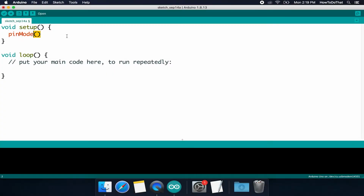Functions have parentheses like this that come after them because inside of these parentheses, we are going to define its arguments. An argument is just something that a function needs in order to do its job. So we need to supply it some type of information. So what pinMode expects is 2 arguments. One is the pin number. We'll do pin number 2 first. And the second argument, separated by a comma, is if it is input or output. In this case, it is an input, as we've already explained.